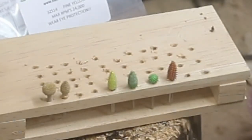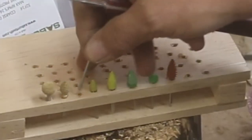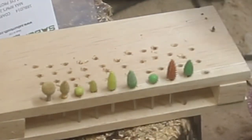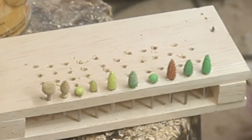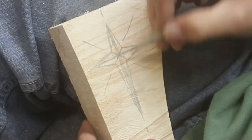Here's a little plate I made — I'll show you that later. I'm starting to put the burrs in there to give you an idea. The two Cuts-All brand new ones are on the left, and here's the setup that came out of the package: I've got an extreme flame, a ball, a taper, a flame, and another ball. The yellow denotes medium or fine grit and the green is coarse. With those two Cuts-Alls on the end, that's $250 worth of burrs right there.